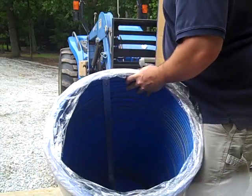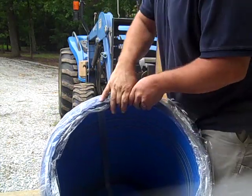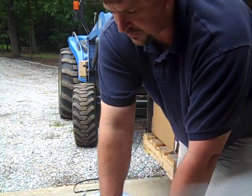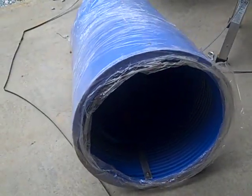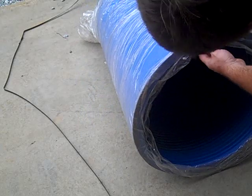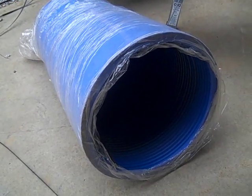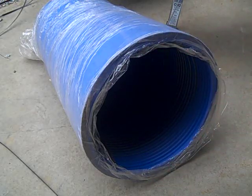The end cap closes it off and this thing will float about the center line of the river. The poly pipe has a screen inlet — it's an Archimedes screw in principle. As the river pump rotates and spins around, it will pick up air; there's a pickup in here and it will go into the water for half the time and out of the water in the air for the rest of the time. What it's doing is building pressure as it spins.